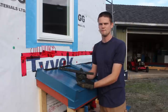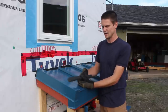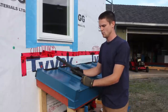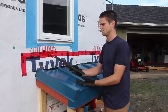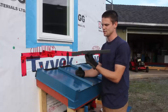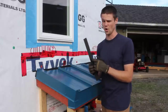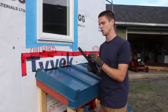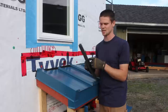And the idea with the vented closure is to allow airflow for things to dry. And as you've seen from some of the techniques we've been using, we're trying to get air gaps everywhere for moisture to evaporate. So rather than just putting this down as is, I'm actually drilling tiny little holes and making our own vented closure. Just using a very small drill bit, small enough that I feel it'd be pretty difficult for an insect to crawl through.